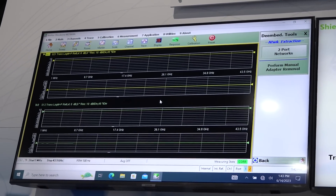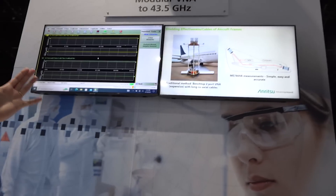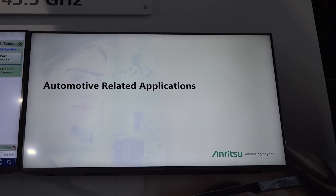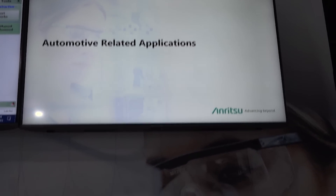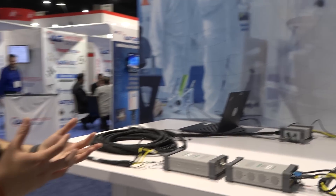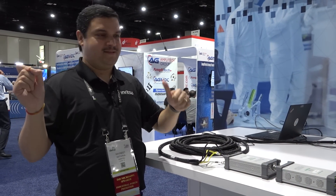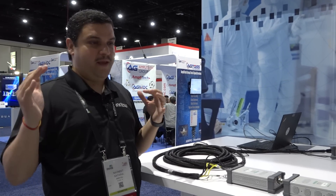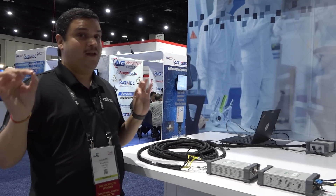This is the advantage of the modular distributed two-port VNA. On the right you can see we do a lot of testing of large vehicles, automotive applications, antenna measurements, and ships — where you have waveguide components that need to be checked for leakage. On aircraft, which has a really wide wingspan, antennas at the wings carry a signal through a coax cable to the cockpit, so you have to make sure there are no leaks in those coaxial cables, which can be really, really long.